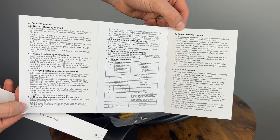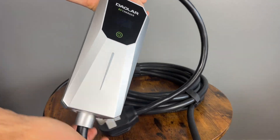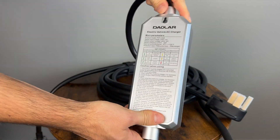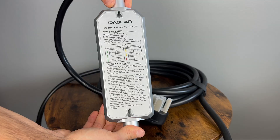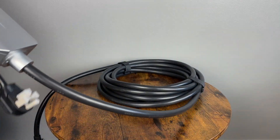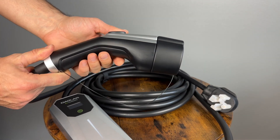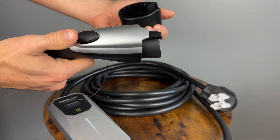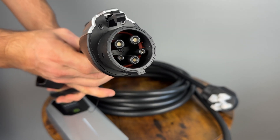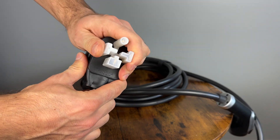It's also good to see what the LED indicator colors mean and how to set up the delay time for charging. The charger is smaller in physical size than I imagined, which is a welcome surprise if it works as expected. We also see a snippet of information from the manual printed on the back of the unit. The cable between the control panel and NEMA 14-50 plug is 10 gauge, so it should have no problem handling 32 amps. On the other end we have the charging head, which comes with a dust cap that takes just a bit of force to remove so it won't fall off when not in use. It feels comfortable in the hand and it's made of plastic. The NEMA 14-50 plug looks to be constructed rather well and fully sealed.